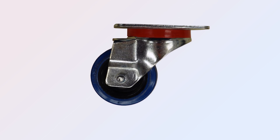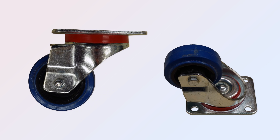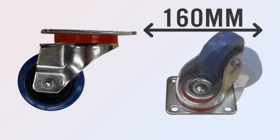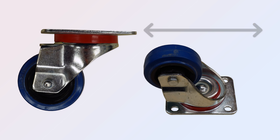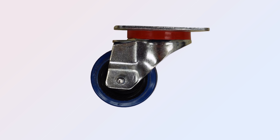The caster I chose is in the description below. It is a simple non-braked caster and has a load capacity of 180 kilograms or 400 pounds, and a swivel sweep of 160 millimeters diameter. This determines the inside size of the leg, as the caster must be able to sweep freely as the bench is moved.